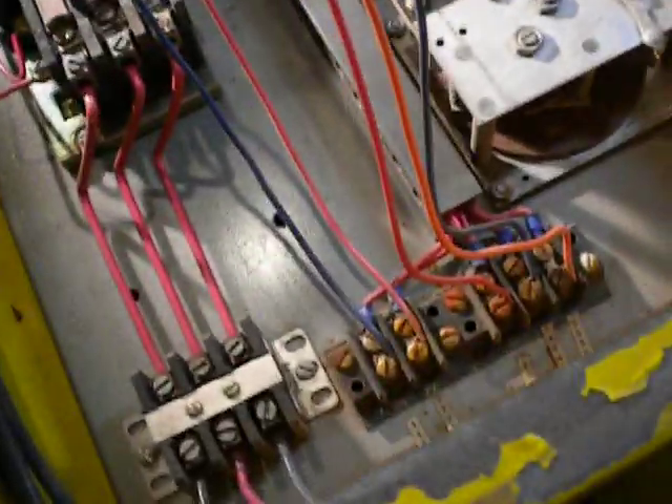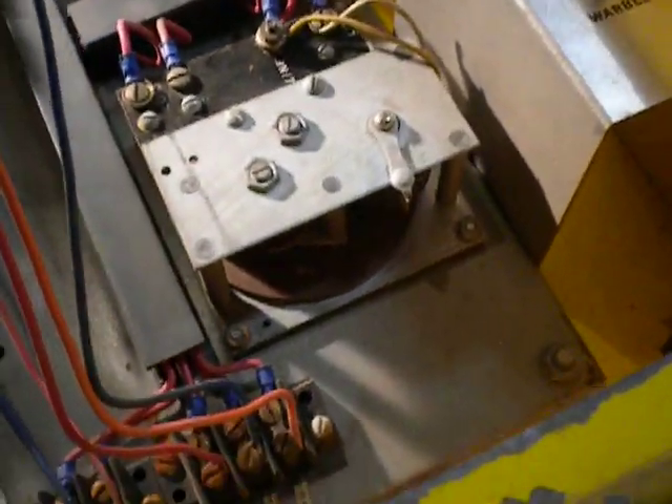I figured I'd do a brief video explaining how this flasher works to the best of my knowledge. It's kind of hard to see down in here, but essentially you've got a little clock motor — it's all gear driven. This bottom wheel spins the fastest and then there's a reduction. You've got cams right here; this disc is the bottom cam and there's one right above it. There's a dip in it that drives the contacts.